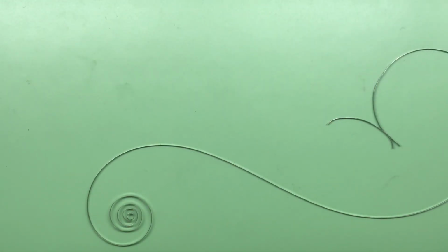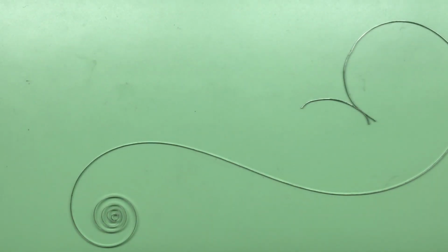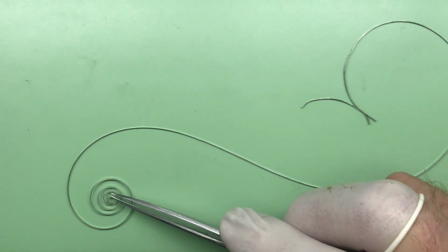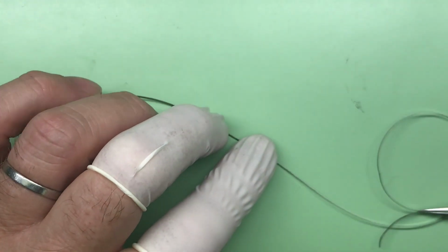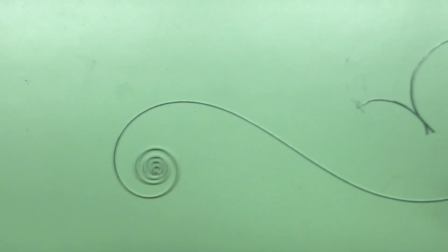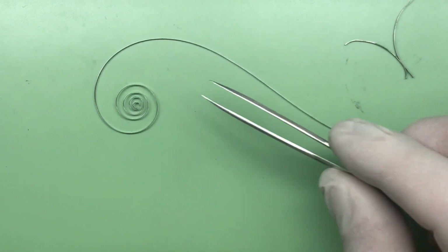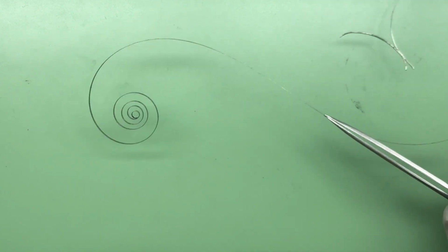Okay, Jock. Well, we're getting ready to get started putting your watch back together. I just wanted to point out a few things before we get going. You're getting a new mainspring. Turns out your mainspring is sprung, for the lack of a better term, but it's fairly heavily coned on this end, and this bridle should be around about like that. So it's lost a lot of its oomph, and there's frictional loss in here as it affects the barrel itself. So this one's going to come back and you get a brand new one, so that's good.